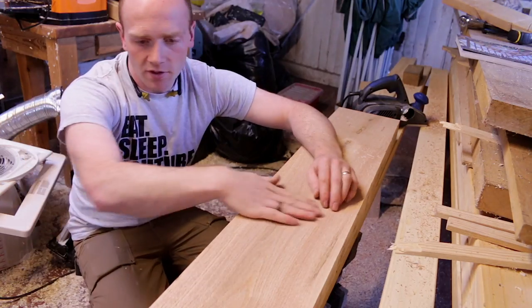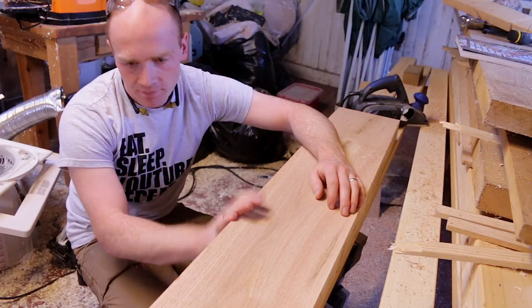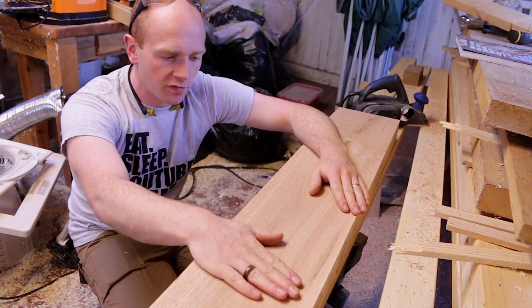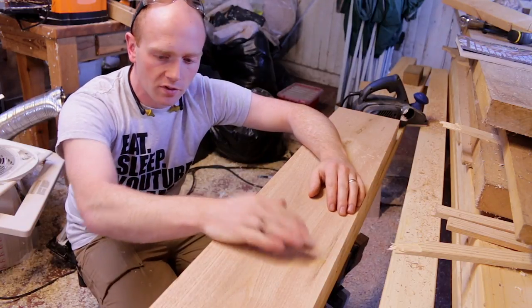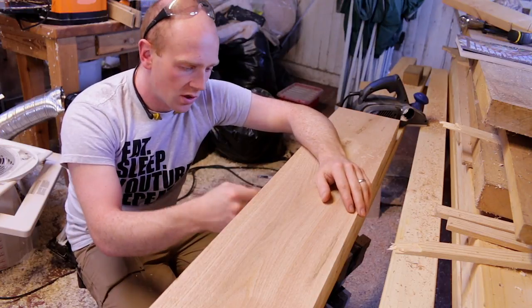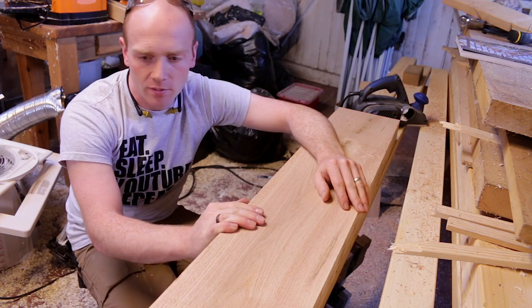That's definitely cleaned it up enough. I'm just going to see if I can plane off this back edge where there's a bit of wane. Now we've got the clean faces — I've left a few saw marks on the top, which are quite nice. There'll be a little bit of that showing; we don't want to make it too clean and flat. The front edge is now nice and smooth, but they were quite keen to have some kind of waney, natural-edge effect, so we'll round over and scoop a little bit out with the plane — maybe the hand plane would be better.